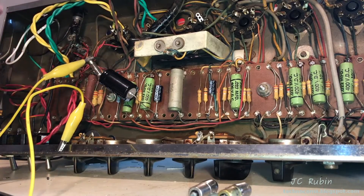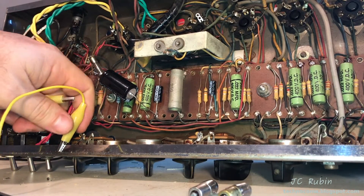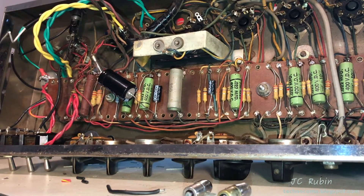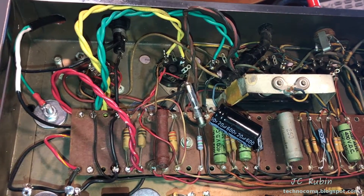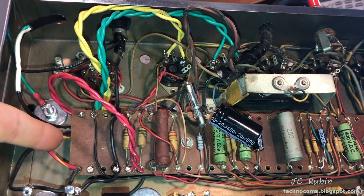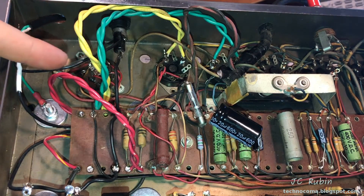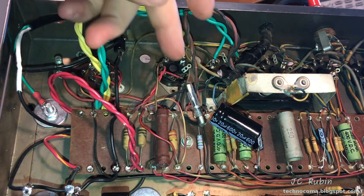Having finally gotten through all of this power supply testing - AC, DC, and rectifier - I feel I'm in a good place to clean all of this up. I've completed the final rewiring, made everything nice and clean, cut everything to size. There's no abundant service loop anymore, so this is all done. I'm going to go through and inspect the rest of the wiring on the power supply side - the stuff I didn't have to work on - make sure everything's good, maybe reflow some stuff and pull some stuff up to give it adequate separation.